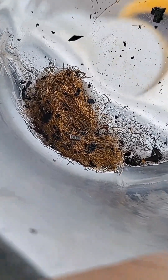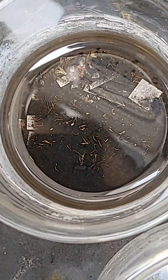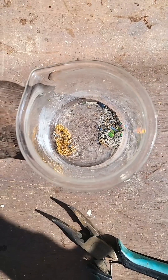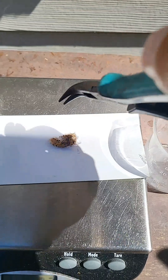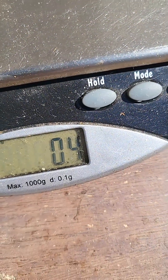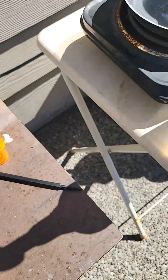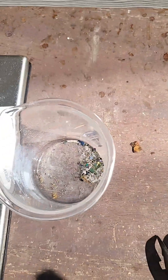This was about 10 of them. I extracted this gold by boiling the chips in concentrated sulfuric acid. This is most of what I got, but I also have this one and this has all the junk. Look at this free gold — these are the gold wires from IC chips. I was going to try to weigh this, so I'll pick it up with these pliers. You can see I was able to pick it up. Look how golden that is — 24 karat gold. And it says that it's a half a gram. I got this from about 10 IC chips, plus there is a lot more here. There's also more in my filter and more in my stock pot. So I'm going to put this into my bottle and purify these.